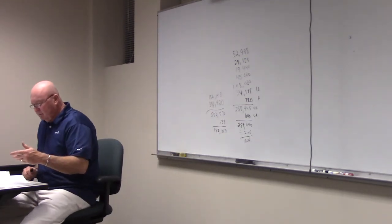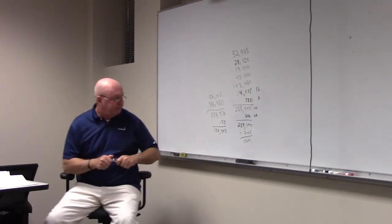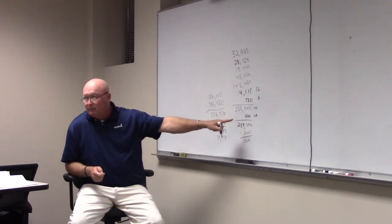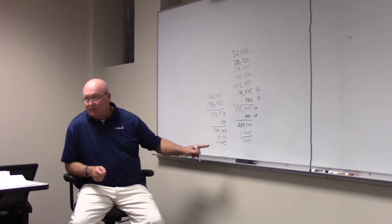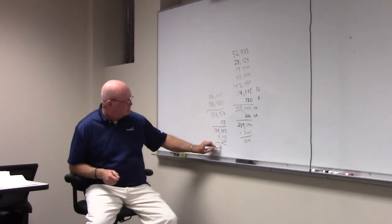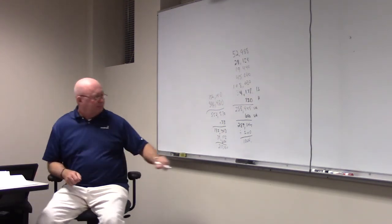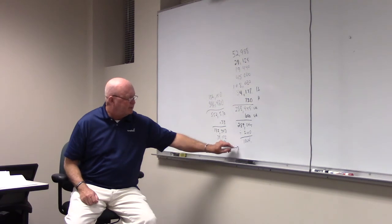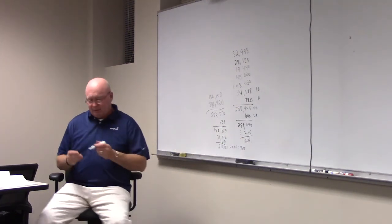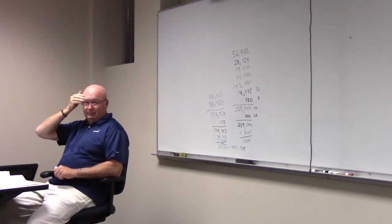Now we have to do our house load, which should come up to the same number we had over here, right? 34,172. We still have a continuous, and we still have the 600. Now how much do those three numbers add up to? 217,120. More or less than the other? Less, didn't it? Now that's divided by 240. How much does that equal? 905. So using the optional method, what size service am I going to use? 1,000. Big difference, isn't there?